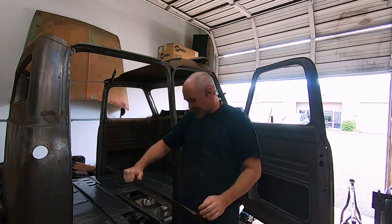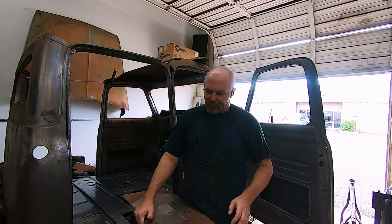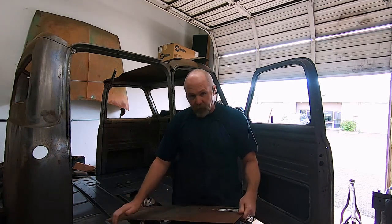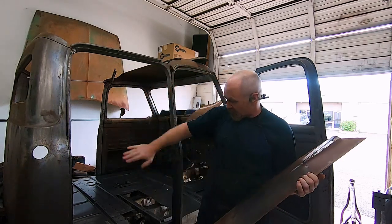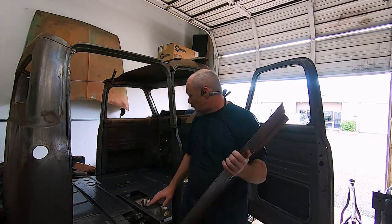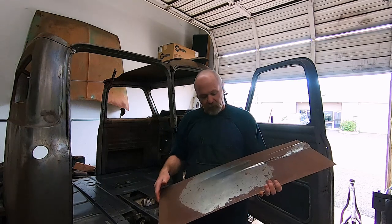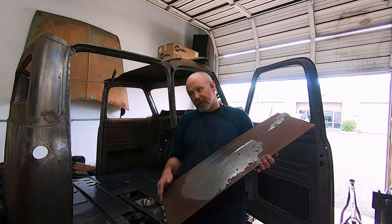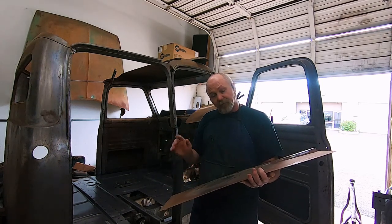This is the piece I made to patch this — I actually made it for the other side. I made an MDF buck with this shape in it. For some reason I thought I'd just do it with two separate ones. What I ended up having to do was English wheel this panel to get a little bit of a curve to it, because that's how the floor is shaped — the floor actually drops off on the sides. Where the seat brace is that I put in, that's flat across. So I needed to have the original contour of the floor and then accommodate that brace — that's what this bump is for. I did a little crown on the English wheel, then did that shape on the MDF buck, which I no longer have. So I'm going to have to make this one work, take the rust off it, and show you how to close the end. Then we'll start trimming it and put in all the bead roll pieces.